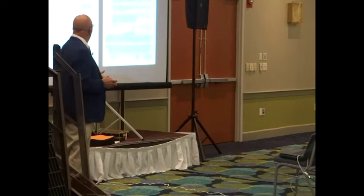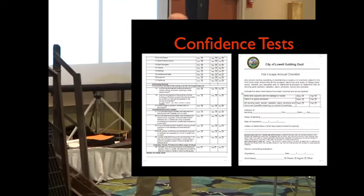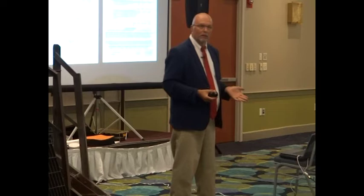So who did that? City of Lowell. This is an older City of Lowell. You have the latest, greatest one, and it includes load testing in their questions. It's all yes-no questions. This makes the design professional put his license on the line, because if he's going to rubber stamp stuff, guess what? You have a false document in your hands. So always keep the first thing he sends, because it comes on their letterhead. And just send them a copy of the Lowell one with your city information on the top.